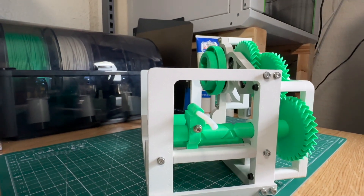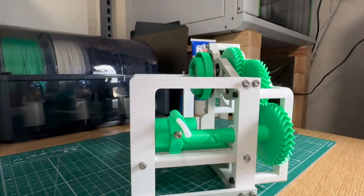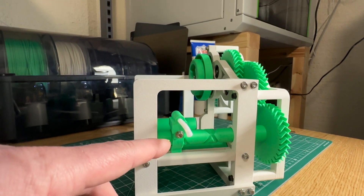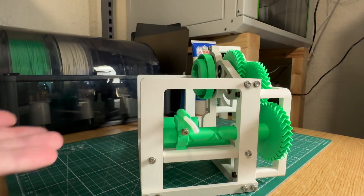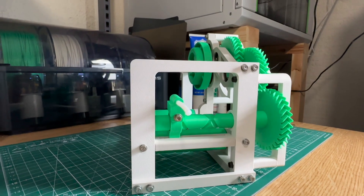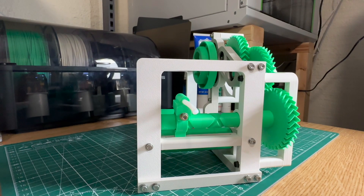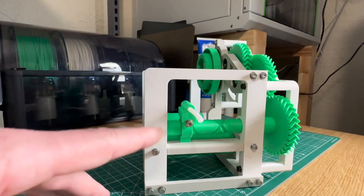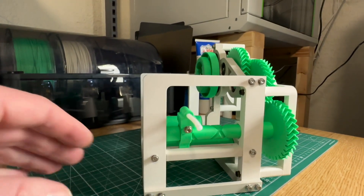We're around the front of the V-Spooler Mini briefly because I want to show you something that we want to bring to the main V-Spooler model in a different form. Here we have a new carrier over the barrel cam. It attaches with a single M3 screw and it also allows you to service the barrel cam and the tooth while you're spooling. When something is going to go wrong it's probably going to happen while you're doing a spool, and this change will allow you to do all this servicing — including the whole gearbox if you want — while you're doing a spool.